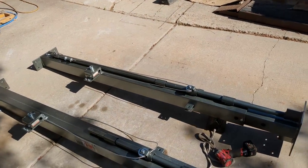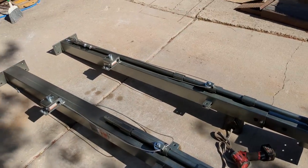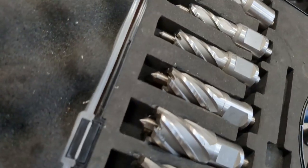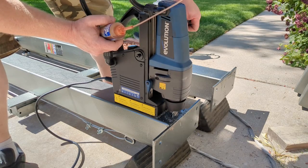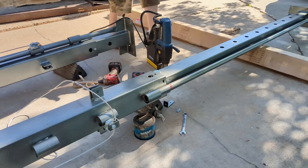Because the top of that tube is open and this is going to live outside, rainwater is just going to fill up the inside. So we're going to have to drill a hole at the bottom just so if any rainwater gets in, it just drains out and doesn't create a big icicle and burst in the winter, or just rust everything solid so it's not movable.